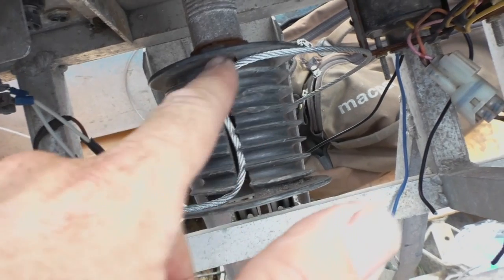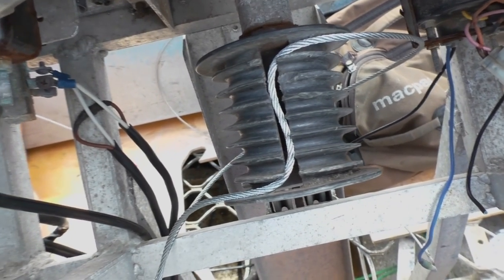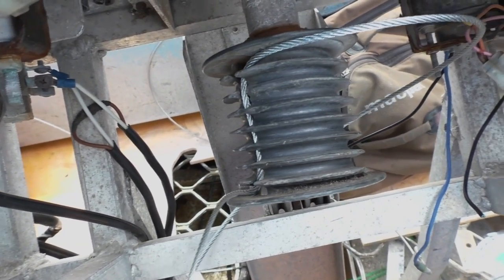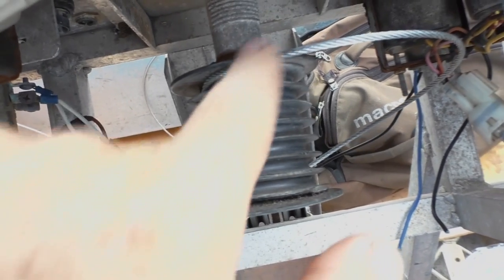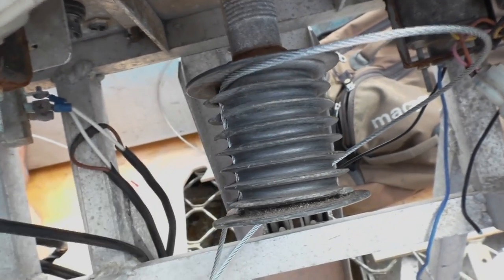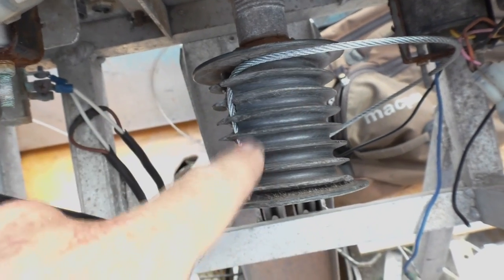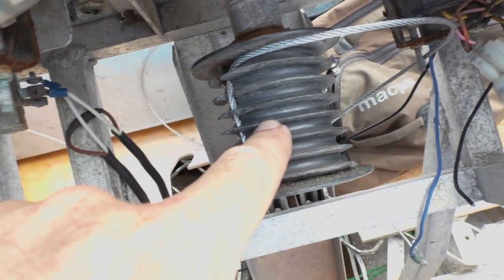So there we go — that's step one. Down through the centre groove, and then off to the two sides. Now what I'm going to do is turn the helm to starboard, and that's going to start winding this cable into the groove — the back half, or the aft half, of the drum. I'm going to keep winding it, using one hand to turn the helm and the other hand just to guide this into the groove, winding it until it reaches about the middle of the drum.